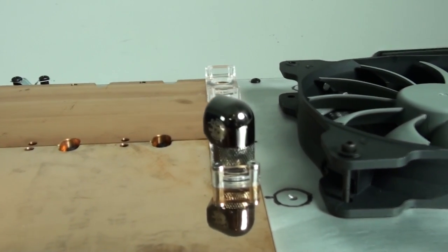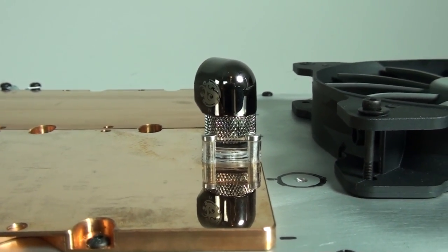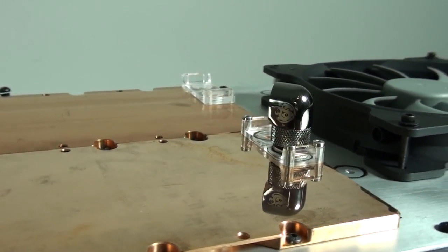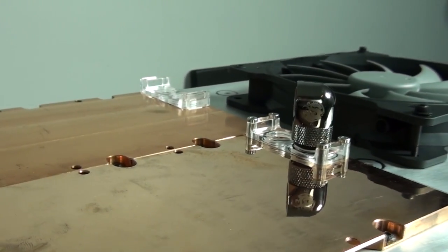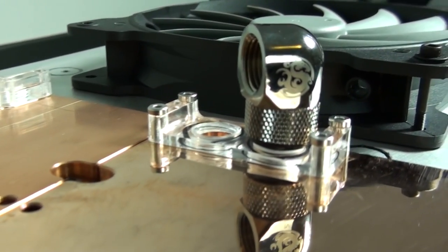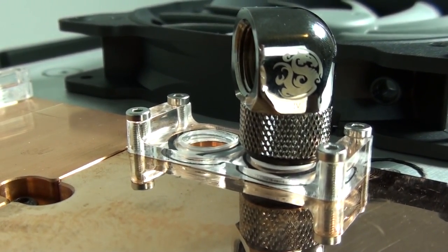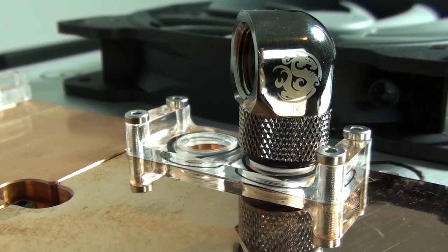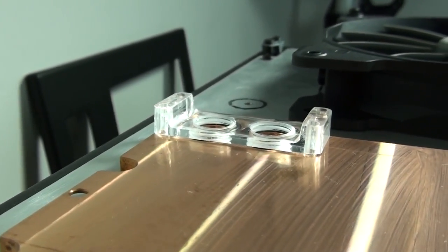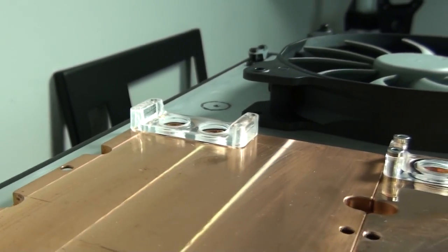But I'm not really happy with this. I left the high sections on either side to improve strength and aesthetics - to create some more shape - but you can see that even now there's not enough strength because the acrylic is bowing up in the middle due to the o-rings, so it's not putting enough pressure on them. It could leak.